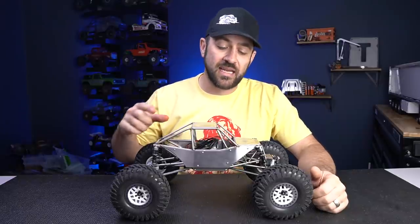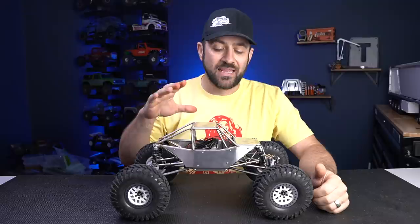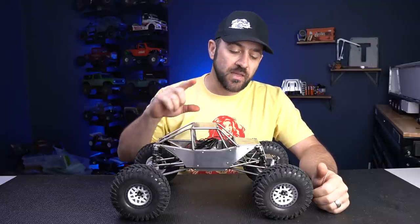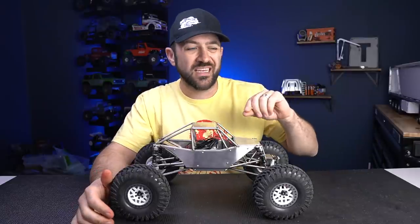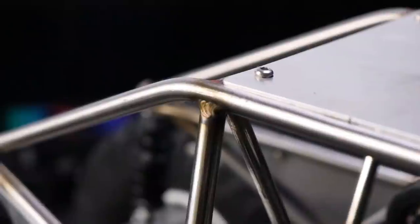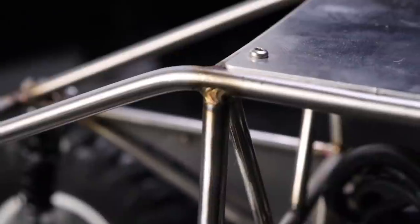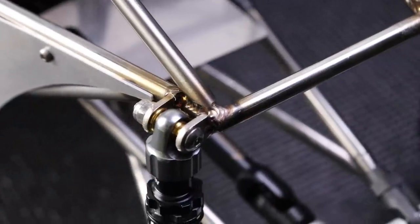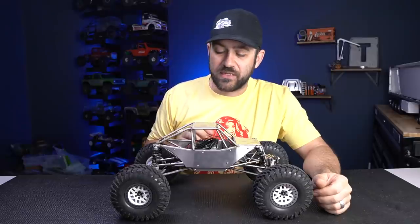The R1 design is stainless steel tubing for the most part, and it's TIG welded — specifically what looks like cold TIG welding, which is a little different than standard TIG welding. It has a different look; you can see the stacked dime appearance on the welds. It's done in a different process, almost like tack welding over and over, and that appears to be what's been used here.